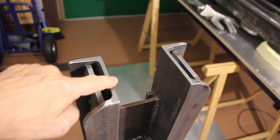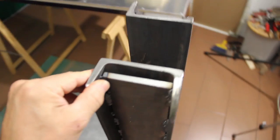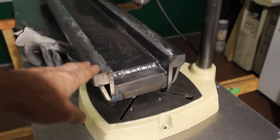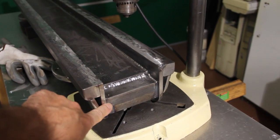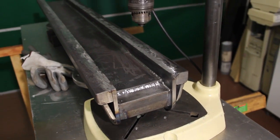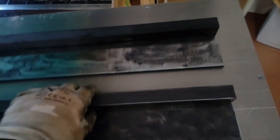On the old piece the thickness of this wall was too thin, and even with the reinforcing flat bar it remains something just patched — I don't like it. So I started with a new design with a really thick shoulder made with 25x25mm welded on a flat 10x100mm, and a tilted bar to form a triangle, of which the void would be filled with concrete to help damp vibrations.